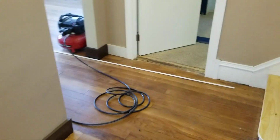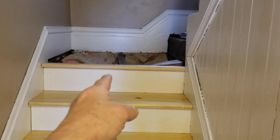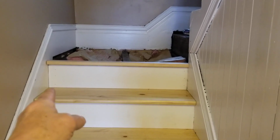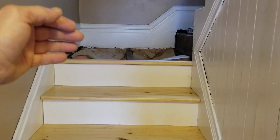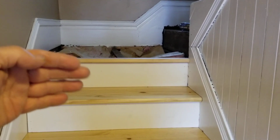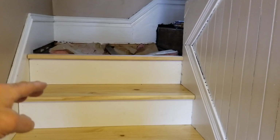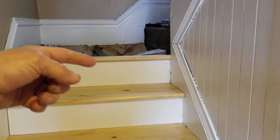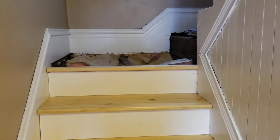So anyway, yeah, it cost a little bit. This is about 35.5 inches. The local Lowe's right down the road only had 8-footers available, so I had to drive an extra 12 miles to a different Lowe's, and they had some 12-footers. So we were trying to be very efficient with our use of materials. With 8-footers, I would only get 2, and I'd have about 2 feet of waste at the end. So by getting 12-footers, I can cut them all about 36 inches long, trim the final length, which is about 35.5, and then we don't get any waste as we go back up through. So I'll be straightening out the insulation and everything there as we go.